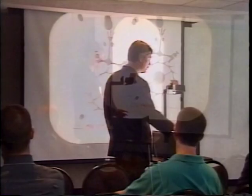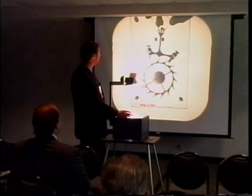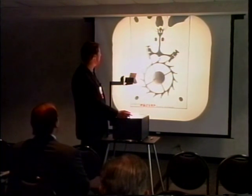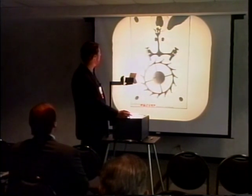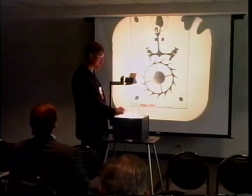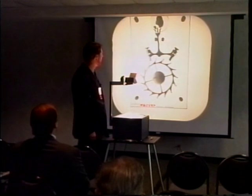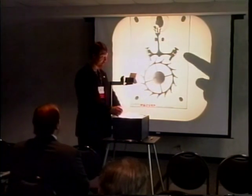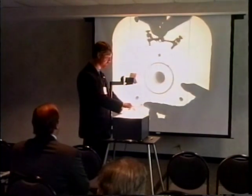Hairspring pulls the roller jewel back towards the fork slot, striking the fork slot, the horn, so that the pallet can unlock. We have unlocking, then what? Impulse to a lock, slide, not much slide on that one, and total lock, okay? A couple other things we want to check or that we want to talk about as far as terms go.